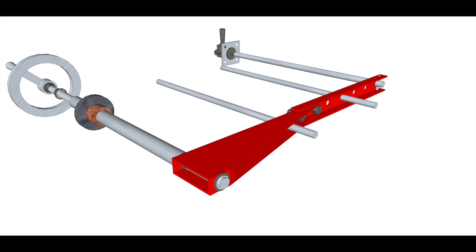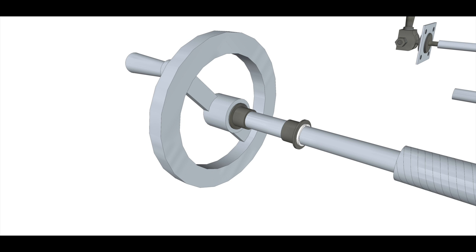We're also thinking that we're going to get rid of the pillow block bearing, or the flange bearing rather, on the front and just use two bushings that are embedded in the front jaw of the vise. This should be as effective or even more effective at keeping that vise jaw parallel and be more cost effective.